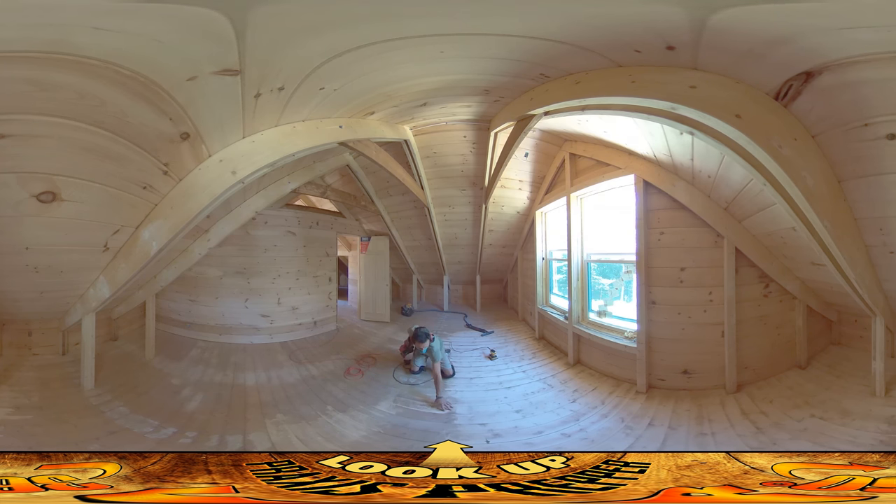You can see here this whole board is higher than these two boards, so this one's getting taken down. I'm just starting to hit the edges of this board. You'll notice I'm at a bit of an angle — normally you'd sand with the grain, but I found that sanding with the grain I was hitting the edges of the boards and it just wasn't working really well. Doing it at an angle helps smooth out the edges, it creates a little bit of a cross grain, but that doesn't bother me since I'm going to be doing another sanding run over this.